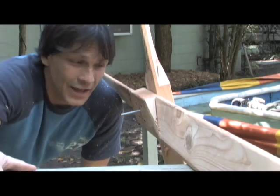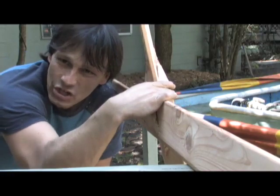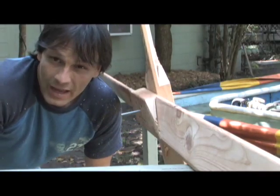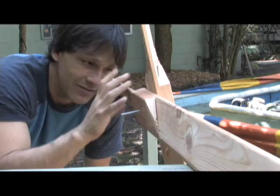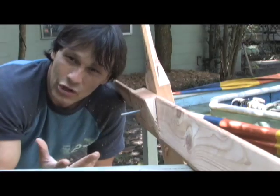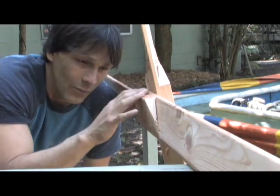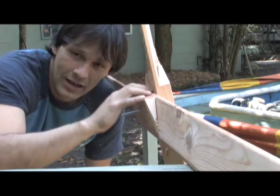For you woodworking guys out there who saw me put this together and rolled your eyes because of the thick chunkiness right in the middle — well, it's not how woodworking guys usually do it. I'm going to show you a simple way to get these together so it's not so thick, it's going to look a lot nicer, though it will take a little more time. It's also going to make the weight more centered to the blade versus leaning forward like this extra blade.